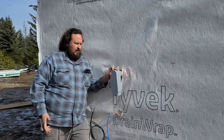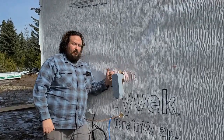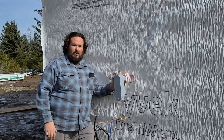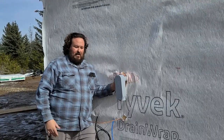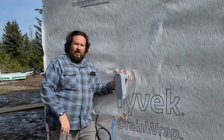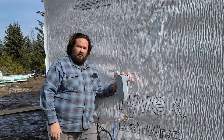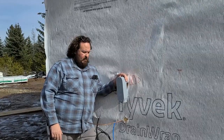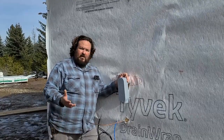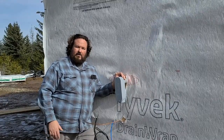Code doesn't want to see four sweeps just because of the difficulty of pulling wire. This is a pretty small conduit that we're putting in. Typically I like to put in a three-inch or spend the money and put in a four-inch, because it's better to have too much and not need it than to bury conduit and find out it's too small or that you can't pull through it and have issues down the road. This is a two-inch conduit — just one wire, 200-amp service from the meter to the panel. It shouldn't be a big deal, but something to think about: better to oversize it than to come up short.